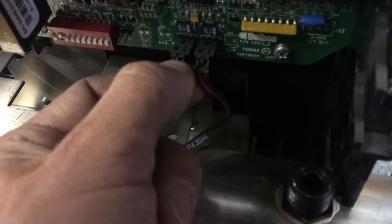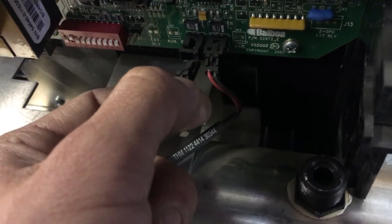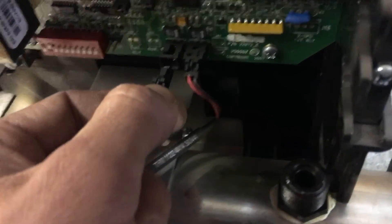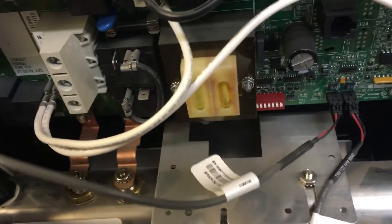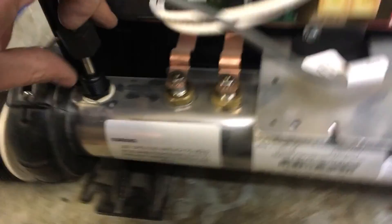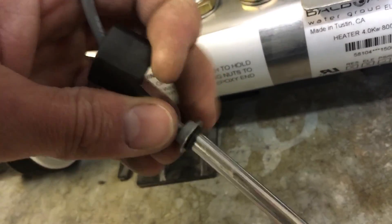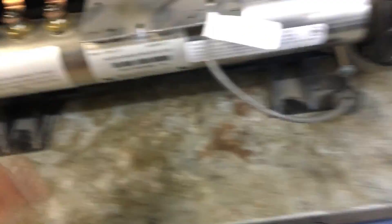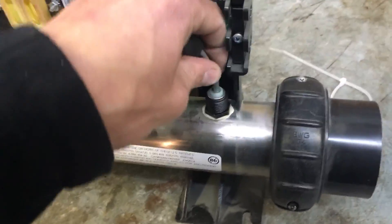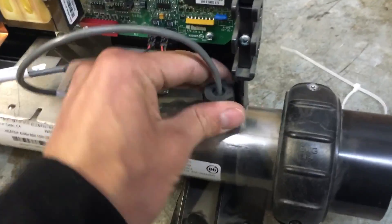The clip has a little pin that you have to squish and pull out. Put it back in. Put the new probe, or the clean probe, back in, ensuring that the O-ring is still on there. That gets set into the probe well. Compression nut on, nice and snug. Same thing on the other side — probe in with the O-ring, compression nut on.